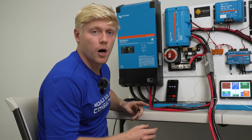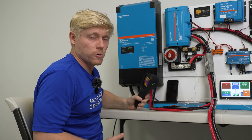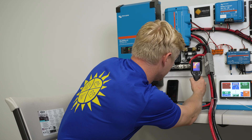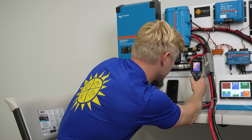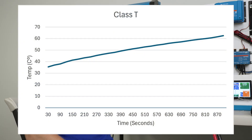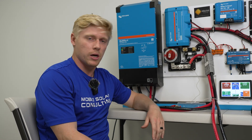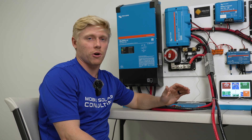We've got our heat guns on now. We're pulling 139 amps and we're going to keep taking measurements with both temperature tools every 30 seconds. We finished our test at 15 minutes, pretty much maxing out the inverter by pulling 140 amps. We got to about 60 degrees Celsius at the hottest point, which is very hot but definitely still perfectly safe and within what we expected. All the cables are a little bit warm, the terminals on the batteries are warm to the touch, but everything's within a normal range.